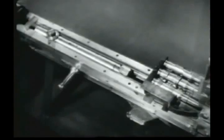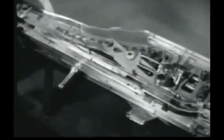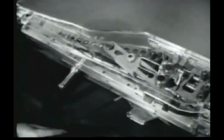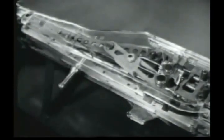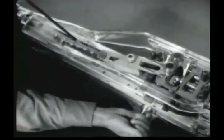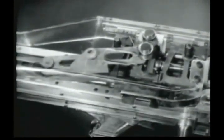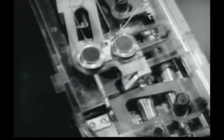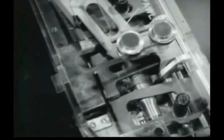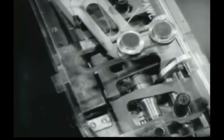The first round is now in front of the bolt and directly behind the chambering ramp. The bolt is carried forward by the operating rod. The actuating cam roller now moves the feed cam to the right. This moves the belt feed pawls to the left. The feed pawls slide over the second round in the belt and then to the left of the round. The feed pawls will stay here until the bolt moves to the rear. This completes the first step, feeding.